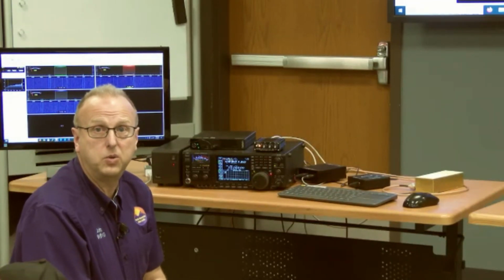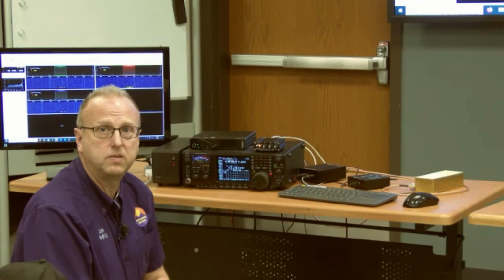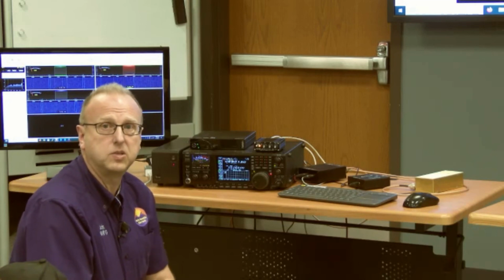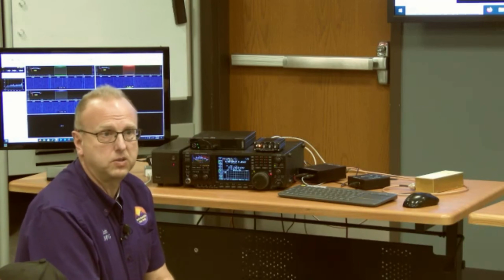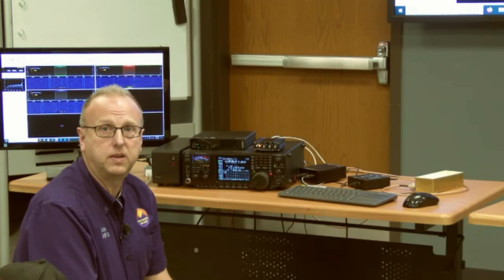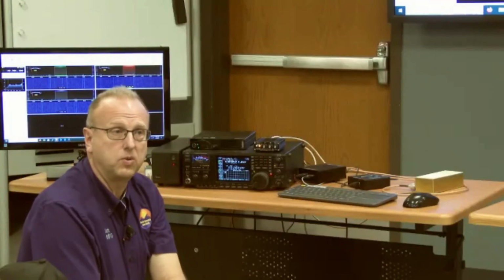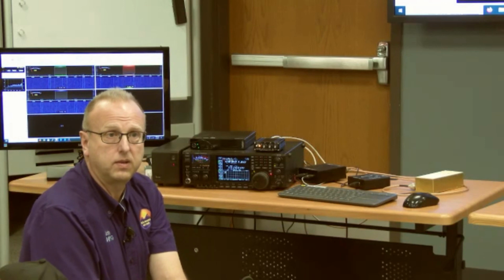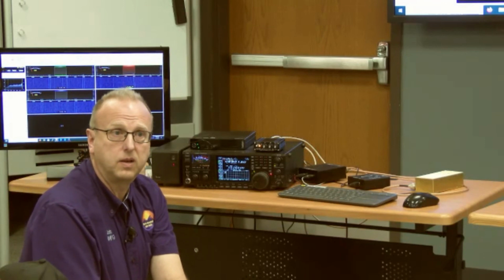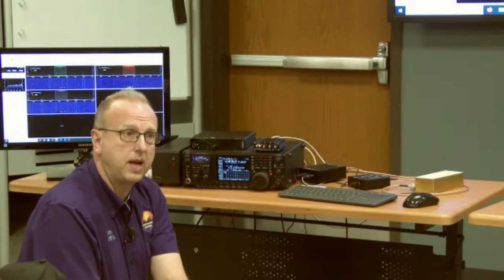It's their version of like the URI. Yeah, their USB radio interface. Yeah, it's a sound card on a USB dongle that has a port that comes out the back that you can do CTCSS, push to talk, carrier squelch, whatever you happen to want to do. Dave Masurovsky, WA1JHK, who's over here running the system, he uses that for the Colorado Repeater Association for a lot of their links and loves them. And I like them significantly better than any of the other devices that we've used in the past. They're very reliable.